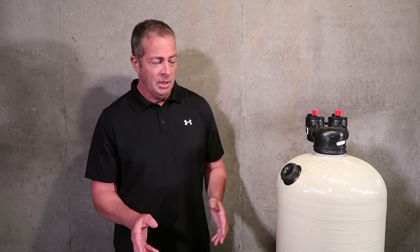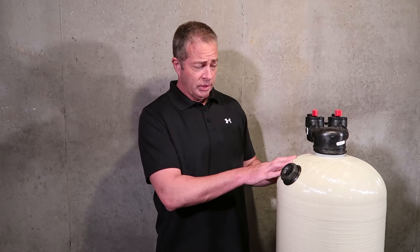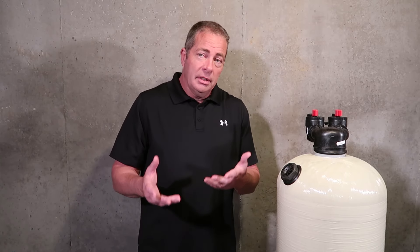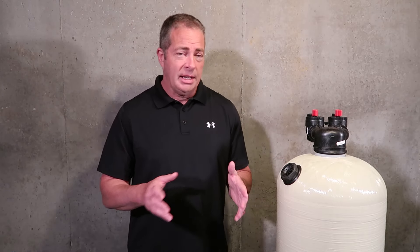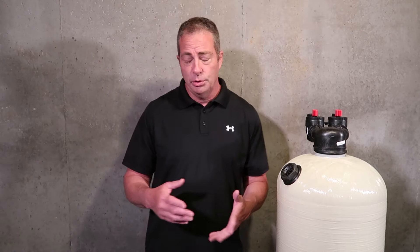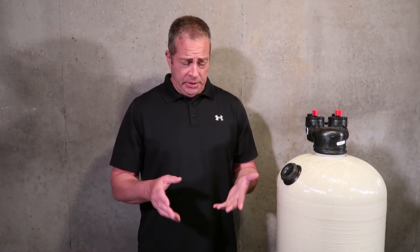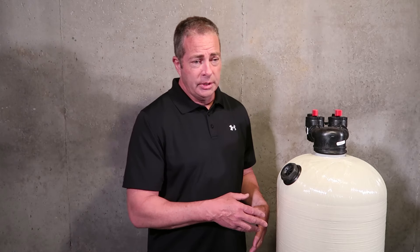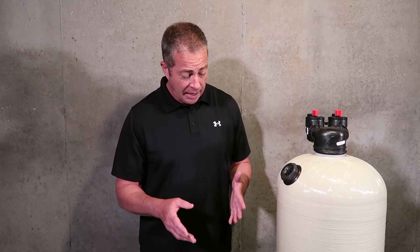You can do it with a backwashing system too — dig a one-foot by one-foot square hole about one to two feet deep and plop it in there. That's why we recommend going with a bigger tank in those situations, because you won't have to worry about servicing as much. With this non-backwashing 2.5 cubic foot unit, you won't have to add calcite as often. Back before we had access to bigger units, using the 1.5 cubic foot systems, we'd have to service local customers every six months on average. Now with the larger units, it could be 18 to 24 months before you actually have to add 50 pounds of calcite.